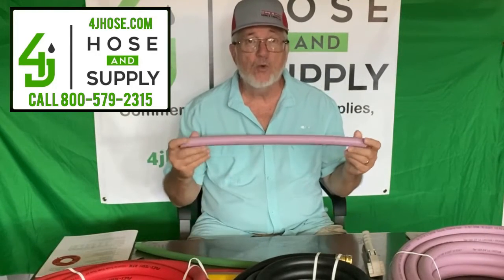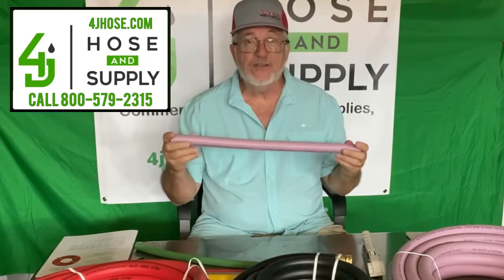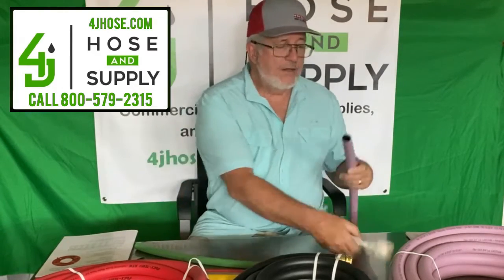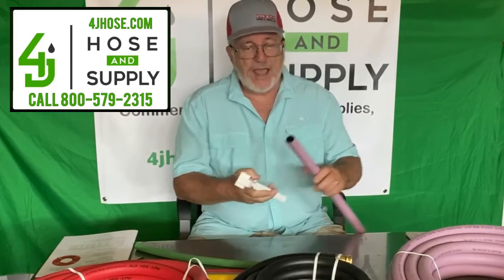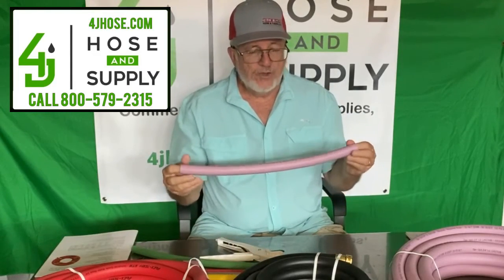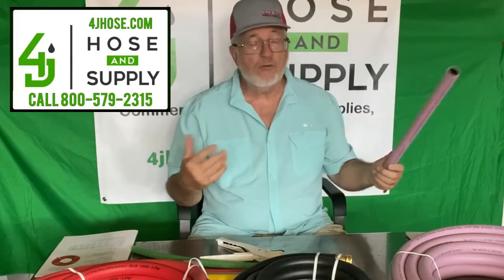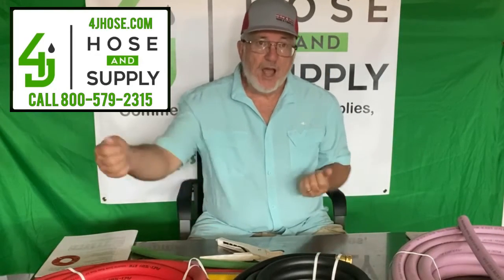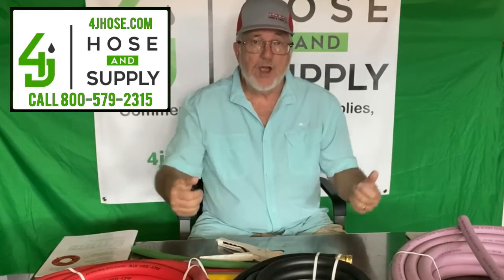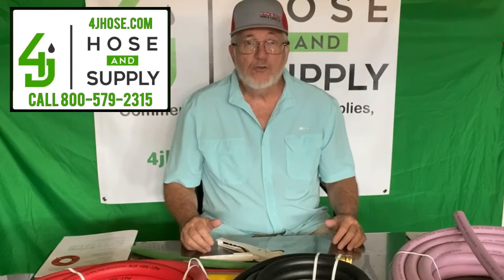Now let's look at the non-potable water hose, also called reclaimed water hose. You're probably familiar with pipe and PEX tubing, but this is something that goes in between. It's a very durable hose made to be outside, and it's very flexible — it can be cut with hose cutters. We sell this in a number of different sizes. It is coated and marked 'do not drink,' and it's for reclaimed water applications. This is good for golf courses, irrigation, and it helps you avoid dealing with a lot of fittings and different pipe because it is pliable — you can work it around corners without the rigidness. Sometimes tubing is not flexible enough and will snap if bent too much. This is an excellent product, called the NPW non-potable water hose, and it's available from FlexTech.